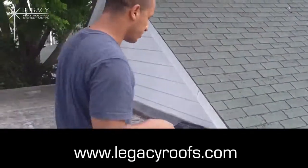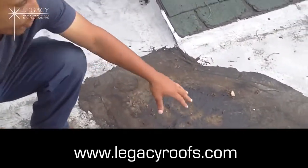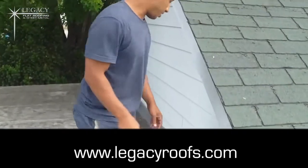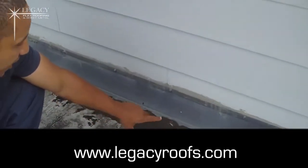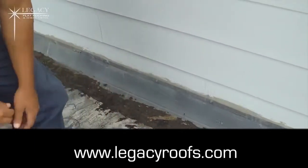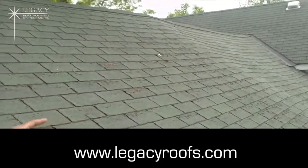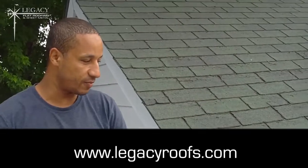I'll show you what the roof looks like. There's a lot of issues with the roof. He's had some patches. You can see we're going to have to put new plywood here. This detail here along the metal siding, we just have basically a cant, and you can see there's been some repairs. So we have the shingles we're doing today also. You can see they're pretty old, and they're past their lifespan. So here we go. We got the full re-roof, shingles and flat roof.